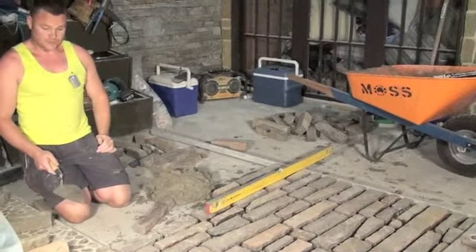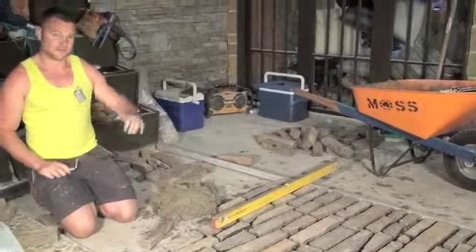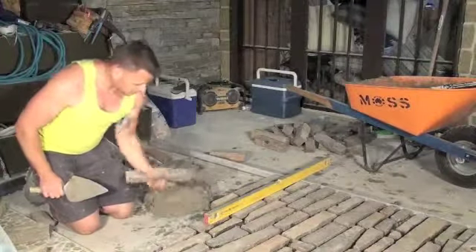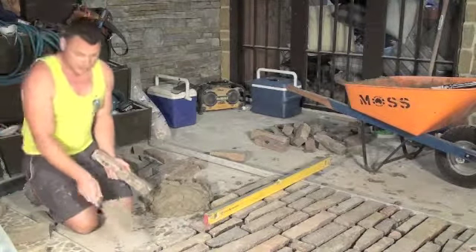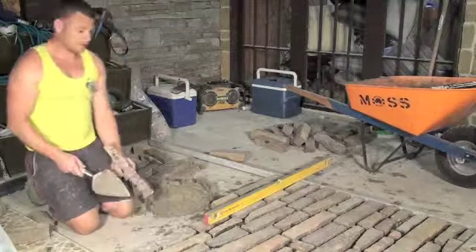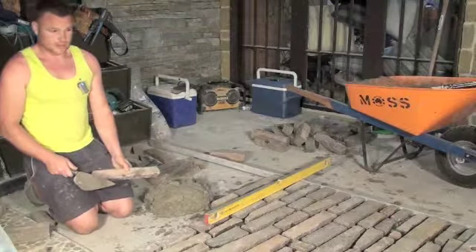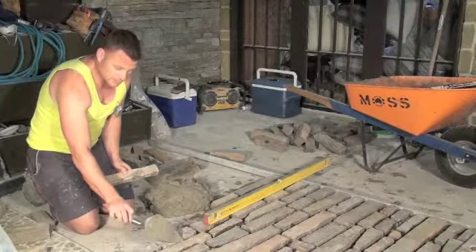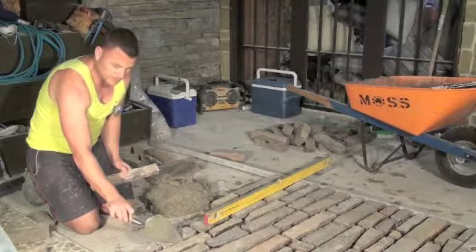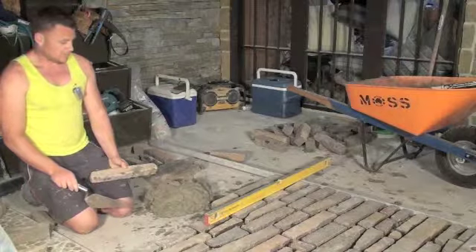Normally you would have about 120 to 150mm to work in because the stone varies in depths. The product is bedded onto a wet bed, and if you are doing it dry in between, we would probably use a little bit of tile glue as well and bed that onto the wet bed just for extra strength. But we're actually filling almost to the top — only going down probably between 5 and 10mm from the top with the grout, so that'll lock it in tight and you won't need any of the tile glue. It'll be strong enough.